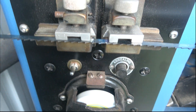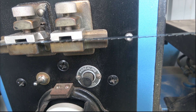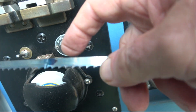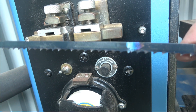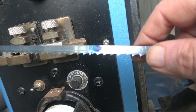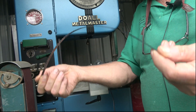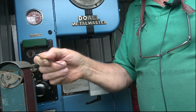There we are, nice and gone blue — job done. I'll turn the grinder off. The other thing I neglected to show you during grinding is that down here there's a thickness gauge. When you're grinding, you check that the blade fits within it. There we are, that's it done. The other thing to check is to make sure you haven't got a little lump on the back — if you have, just rub it with a file. This bandsaw has something like an 18-inch wheel, so to prove it's okay I'm going to flex the blade — that's a much smaller radius than the wheel, and there we are, good job.